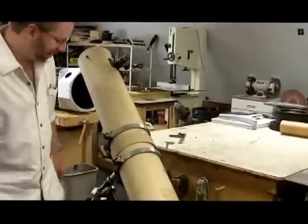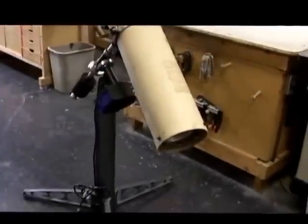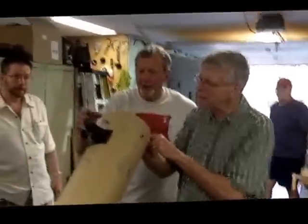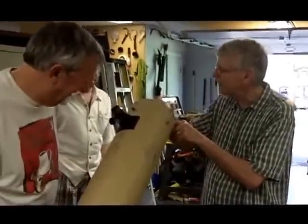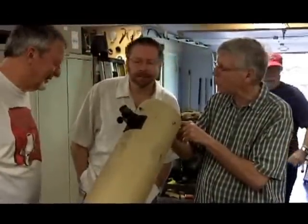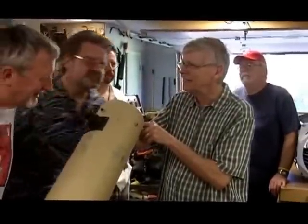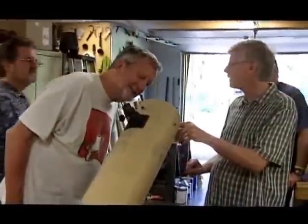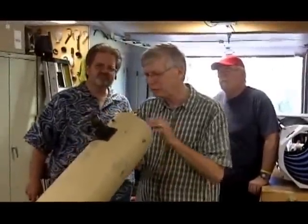It should look really neat — a very nice restored scope from the 1960s, almost completed now. During reassembly, the center bolt was found to be bent, so it was removed, bent back, and the threads were cleaned out. The bolts on the inside are American standard quarter-twenty thread, but a metric number 10 wrench fits the quarter-twenty nut, which is how they were tightened. The collimation should still be good if it wasn't bounced around too much.